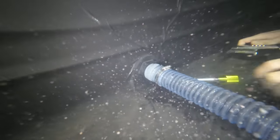Despite all my screen gutters and pre-filters, there is a small amount of sediment that inevitably gets into the tank and settles down to the bottom. Because the occasional leaf debris may float on the very surface of the water, the cleanest water zone winds up being about 6 inches below the surface of the water. If you pull water straight off the floor, you are likely to suck up sediment and clog filters very quickly. So I plumbed up this special floating filter that pulls the water exclusively from 6 inches below the surface rather than sucking silt off the bottom. You can make your own out of all sorts of clever parts, but I was feeling lazy, so I just bought this online.